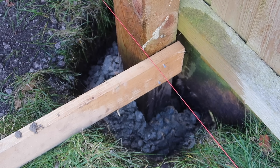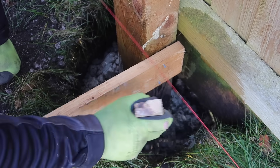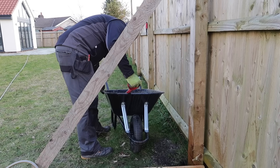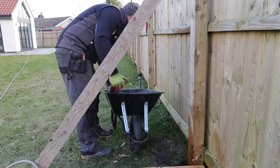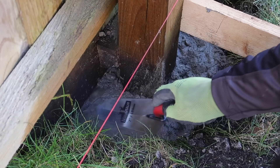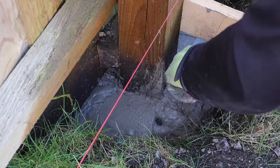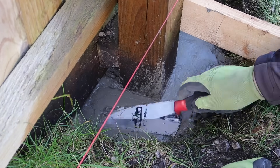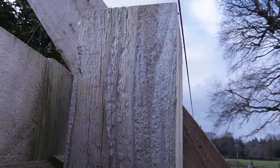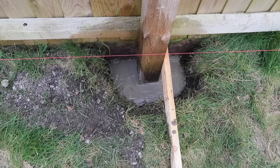This hole took two bags of ballast with cement in total. I made sure the concrete was well compacted in the hole and around the back of the post just by using a piece of timber, and then floated off the surface with a fall away from the post to make sure that future rainwater doesn't pond next to the timber and reduce its life. I left the A-frame in place for two days to get some good strength on the concrete before dismantling it and filling in the hole.